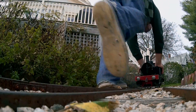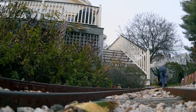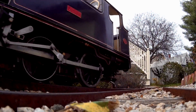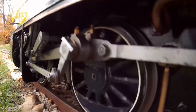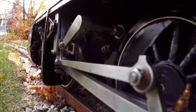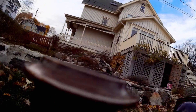Before I fired it up and put the smoke box door on, I decided I'd run it round the yard a little bit, just pumping it up on its own air. That gave me a chance to listen for any more air leaks in the more obscure pipework by means of a hissing, and also just to let it go down the yard and take some interesting shots with my new little camera. Looking in the smoke box you can see the main steam pipe, the superheater, and the petticoat pipe. Then as you come round to the chimney and look down it, you can see the four jets of the blower plus the main exhaust pipe in the middle.